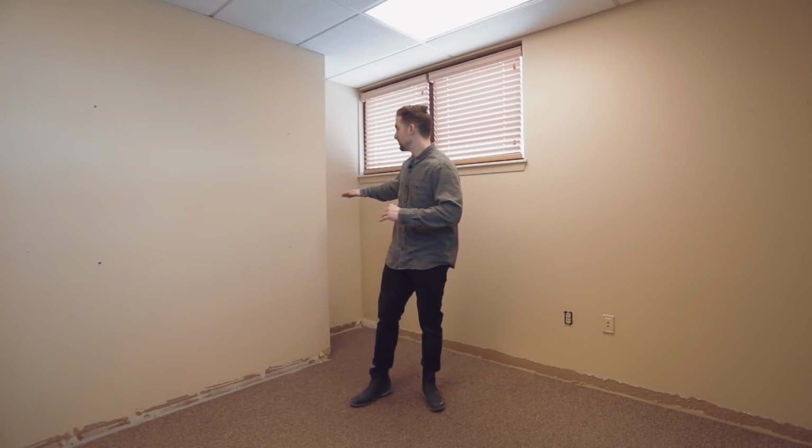A little higher splits 3/4 of the wall, or about half the wall, which is typically where you see that wainscoting or batten board. So we're going to go with the 36-inch high range that we're looking for. A little bit lower, because this space is smaller, we don't have high ceilings, and it's a little tighter. So that's the reason we're going to go with a lower sitting wainscoting.